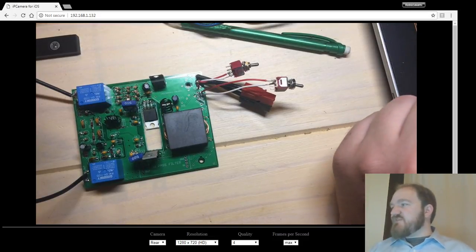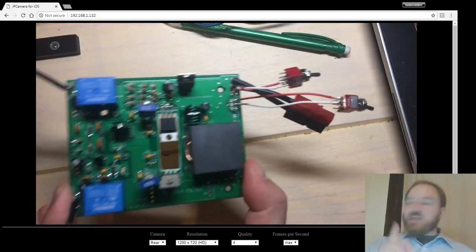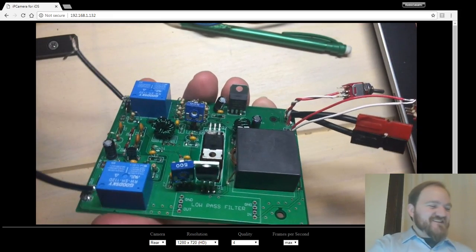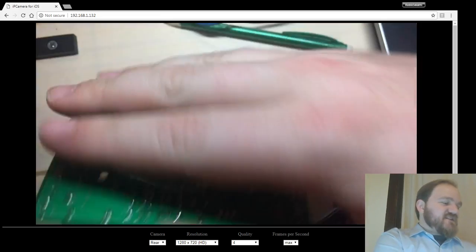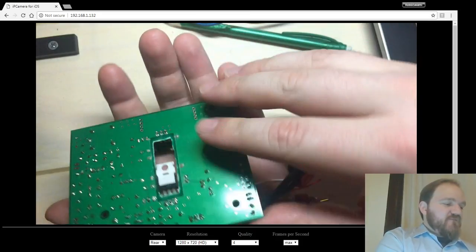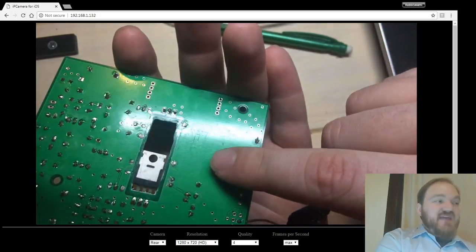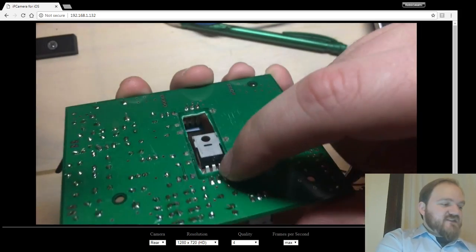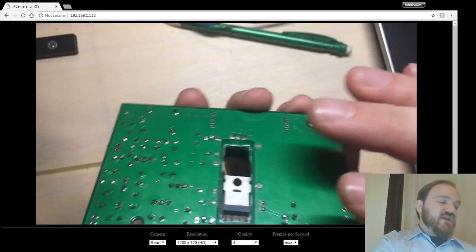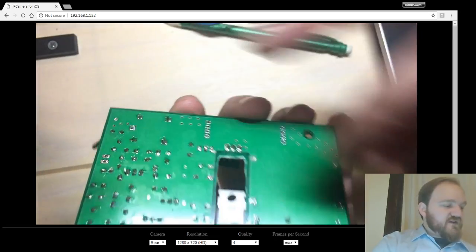Ken says, lol, CPU heatsink plus very careful placement of spacers or insulation for all those other through-hole components. Yeah, it's true. So, I'm not sure if you were in the room, Kenneth. The idea is that the box that we're designing today, this is the whole theory of this stream, is that the case, which is the underside of this, only has a cutout in this same PCB profile. Now, I am going to have to think a little bit about what the clearance is between the bottom of this PCB and the bottom of that box, so that I can still get all my through-hole components not crushed. But in theory, my interface between the PCB and the heatsink is only in this same footprint.